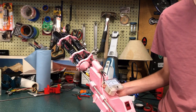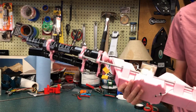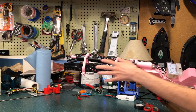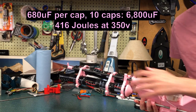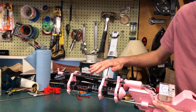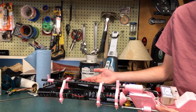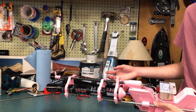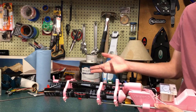It should be a bit more sturdy than the other one because it's built around these metal bars, although the bars aren't long enough so it kind of droops at the end — I'll have to get bigger ones. It's got a lot more larger capacitors so it can store a lot more power — I'll put the exact number up on the screen. One interesting change is something that a commenter suggested: use no metal in the barrel and projectile system. The projectiles are plastic, which is partly so I can use BBs conveniently, but it also means there is no metal in this. Since metal is pretty conductive to heat, it probably sucks a lot of heat out of the plasma, which means there's less energy to expand the plasma and push the projectile.